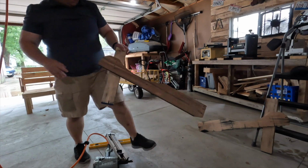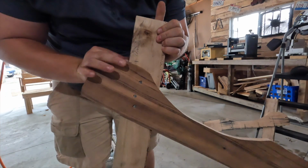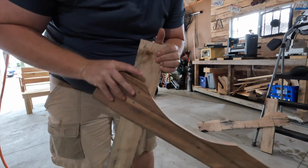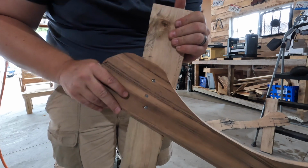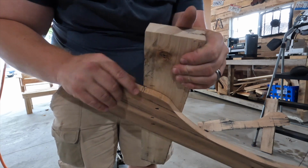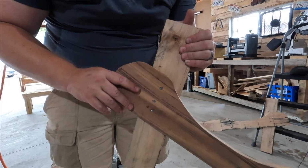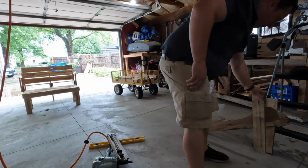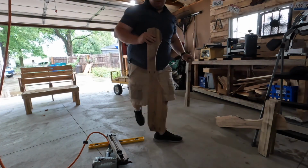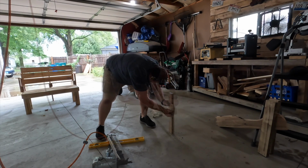This second one went way easier because I went off of the first. I put a notch right at 15 3/4 inches, right on the edge, which is where I was on that one. And I'm actually okay with that because I felt like it was a little high. And then of course I told you I had my mark across this. So I joined it, held it right there, put at least 1 in, and I was good to go. So I'm going off of the first one, and we're uniform. Same exact process. I've got a notch there, I've got a notch here.